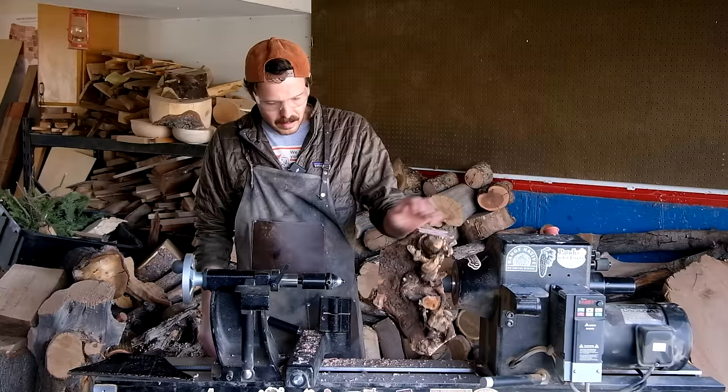It's tomorrow now — one day later. I wasn't able to get everything finished up yesterday, so I had to leave this hanging on the lathe, but we made some good progress and I am loving the color we're finding in here. A couple of things I'm a little concerned about: this section right here is tucked in pretty deep. Ideally we have a bowl shape on this exterior all the way around. This is going to be a weird piece — this is not meant to be like a perfect bowl, just meant to highlight as much of the cool roots going on here as possible. I might bring this bottom in a little bit tighter. I'm also worried when I flip this thing around we're just going to have big chunks of these roots flying off. Let's jump back on this.